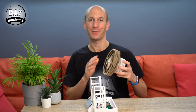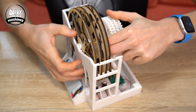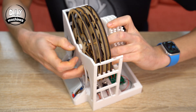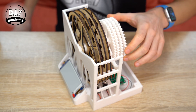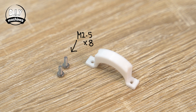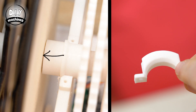We can now take the axle that we made earlier and insert it inside the main body. To do this, you should line up the four discs with the notches found in the sides and the base of your print. Lower it into place and then gently push open the front frame so that the front of the shaft can fit into the recess at the front. A 3D printable axle cap will hold all of this down in place using two M2.5x8mm bolts. Make sure that the chamfered side of the arch is facing towards the scene discs.